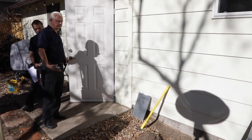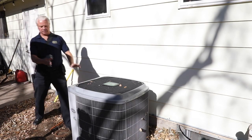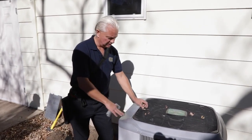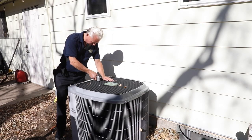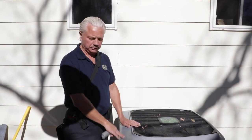We're starting section 3.5 cooling. First thing we need to do is make sure that the air conditioner is warm enough to operate. We've had some snow recently, so unless it's sitting in the sunshine, it probably isn't going to work. We shoot the compressor with the IR gun to make sure we're at least 65 degrees. We're at 84, so we're fine to run this air conditioner.